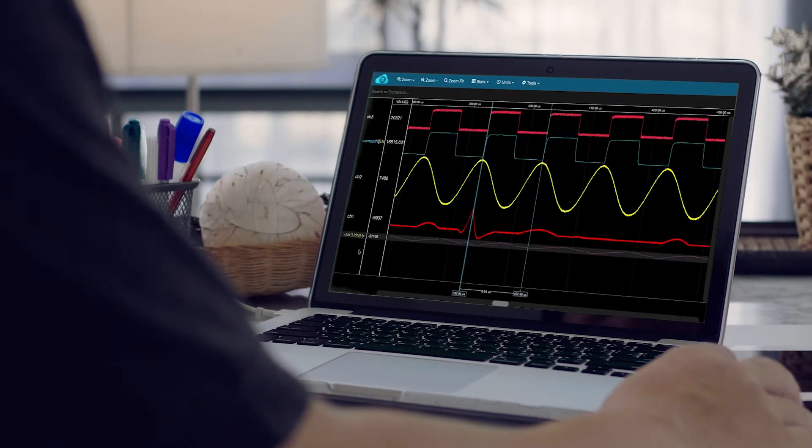You can also connect a mouse and keyboard to operate the scope. You can remotely control the oscilloscope from a PC using the programmatic interface. The 2 Series MSO has a built-in PI translator that automatically translates PI commands, making it easy to replace or add to an existing system. The 2 Series MSO also has several remote operation and collaboration tools with TekDrive, TekScope, and a built-in VNC server. The built-in VNC server enables you to quickly connect to the 2 Series MSO from anywhere with any device. Once connected, you can operate the instrument as if you are in front of it. This is very useful when the instrument is located in an unsafe area or when it's connected to other instruments in the lab or your home.